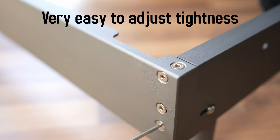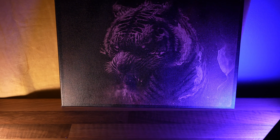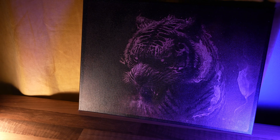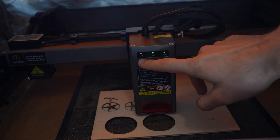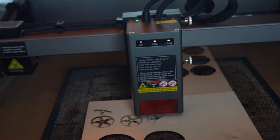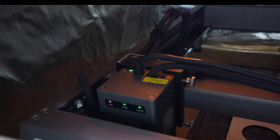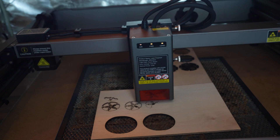You can solve the backlash problem by tightening the drive belt, but when engraving anything that's at least medium size you don't see this problem — for example, a canvas printed at around maximum speed and 20% power shows no backlash signs. Another cool feature are the indicator lights on the laser module: air, fire, and lens. If the lens is dirty it goes from green to yellow to red; fire will flash red; and bad airflow also starts indicating red. Press the reset button at the top to recalibrate.